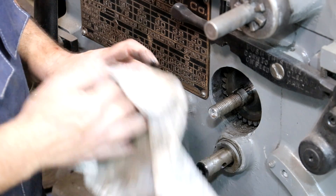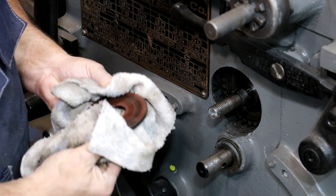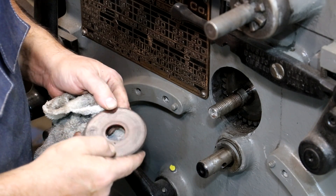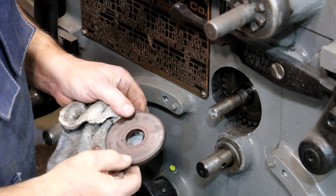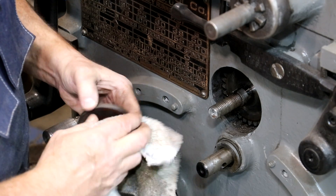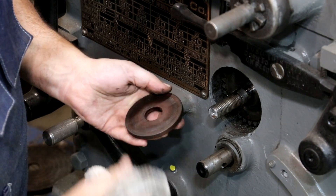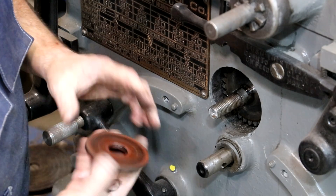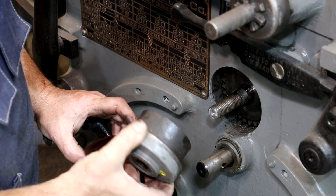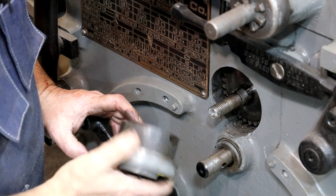According to the manual, it said leather or asbestos. I'm not sure what this material is — I don't believe it's asbestos. It looks just more like a piece of plastic or bakelite or something like that. But it appears to be in good shape, which is the main thing I wanted to inspect. I wanted to make sure if these were leather washers that they had not all deteriorated and gone. So I'm happy with that. While I've got this apart, I'm going to clean this piece up — this is just the piece that kind of presses in and out — and we'll put this back together.